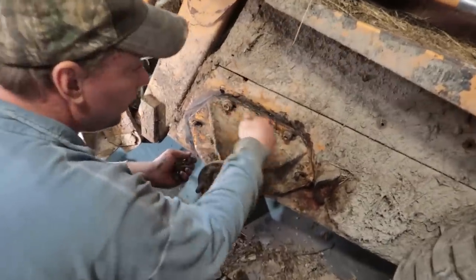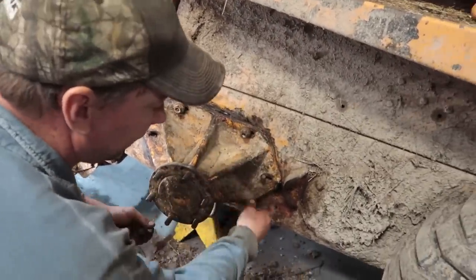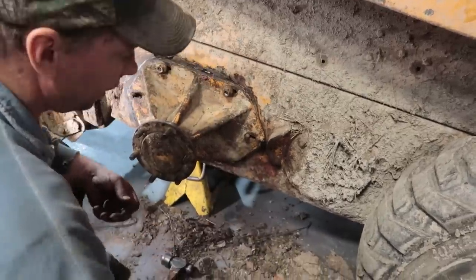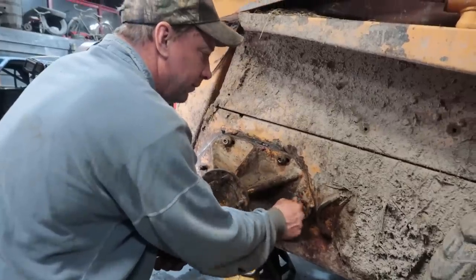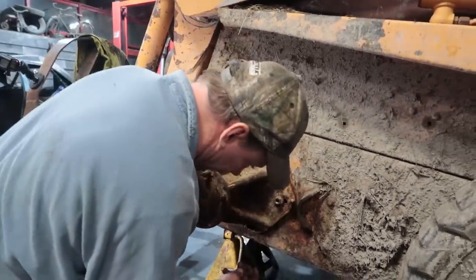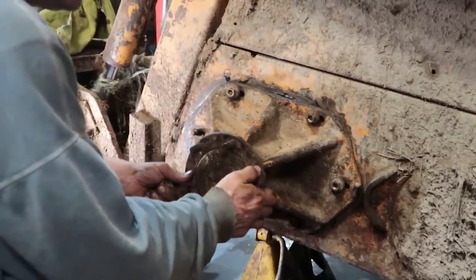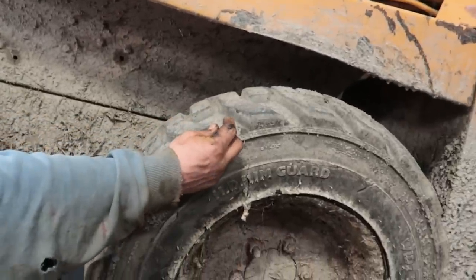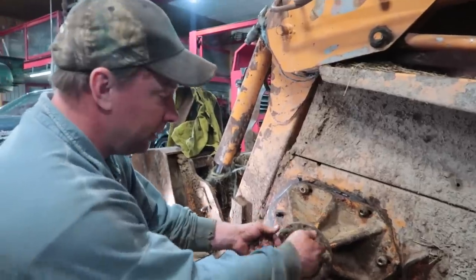You just want to get these on there snug. Then put the adjusting bolts in and slide it forward to snug that chain. Can you over-tighten it? Yeah, you could — you'd be putting side load on that orbital motor, which would not be good. You want to tighten it so it just rocks just a tiny little bit. The wheel is supposed to have just a little rock in the tire, that's about what you want.